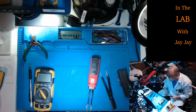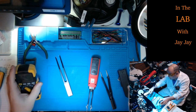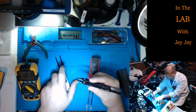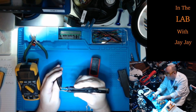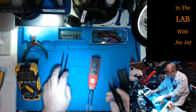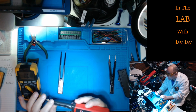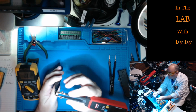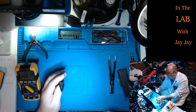So here we are on the bench. I've got a couple of tools here for measuring resistance. Let's do that first. This is the DT71 - it's a pretty flimsy meter but let's give it a reading. It says open circuit - there's no resistance across those pins at the moment. So DT71 says open circuit. Now this is an SMD tester, the UT116A - it's another tweezer tester. We've got it in ohms mode and across the contacts we've got open circuit.